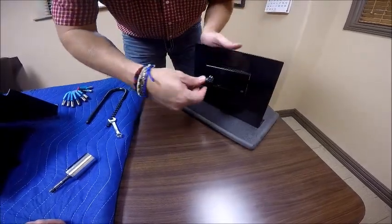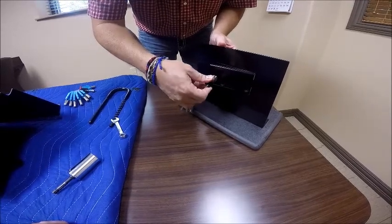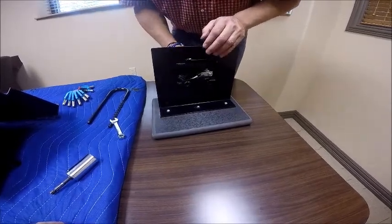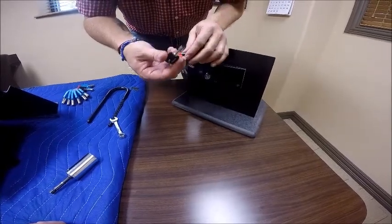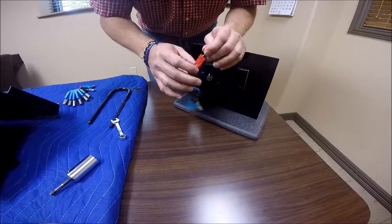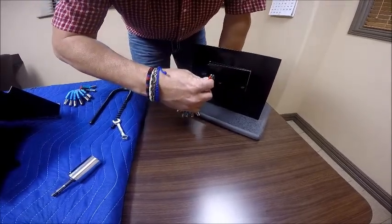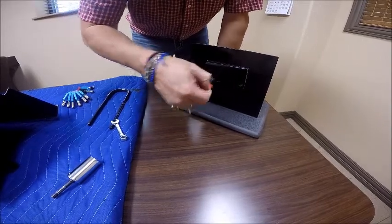First of all, we will confirm that we have the stop washer on the correct way. The lock is rotating counterclockwise. I feel it engaging the spring from behind. This lock is correctly installed and in position number one. Now, knowing that the store is position four, always the serial number oriented to the floor, we will insert it one and turn it two, three, four.